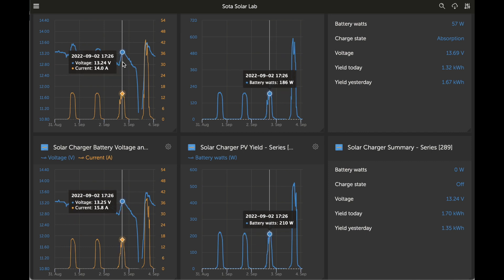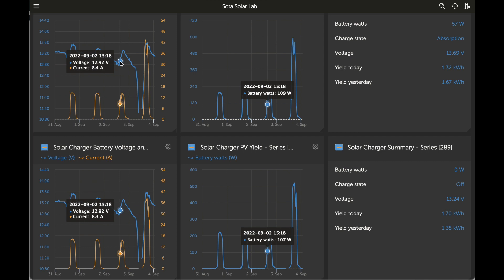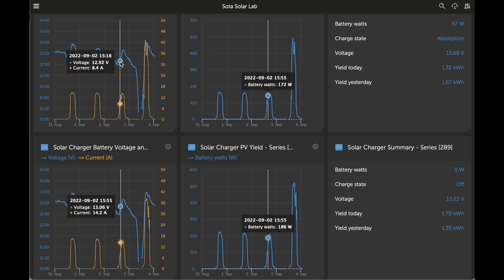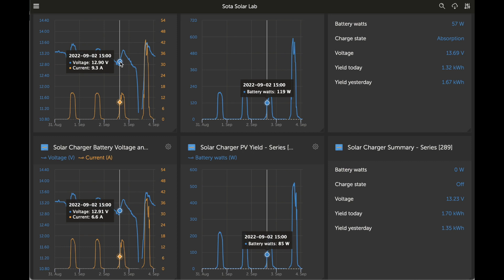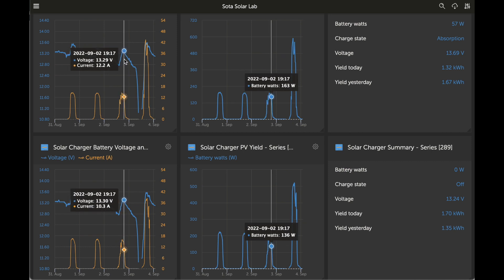And that's the thing. In good conditions, series does much better. You're getting like 0.1 or 0.2 amps better in partial shade versus two or three amps better in full sun. So that's why I would generally go series — get your PV voltage up as high as possible, as high as your charge controller will allow. That's what I would recommend every time.